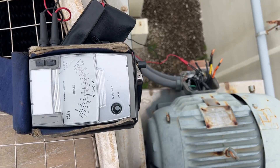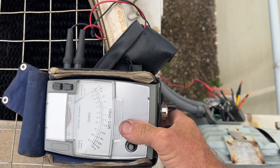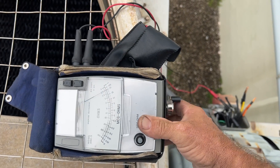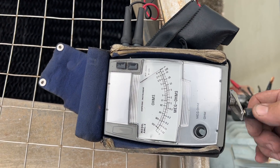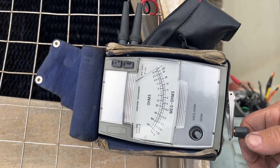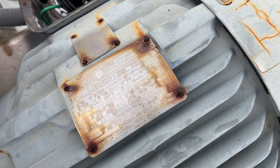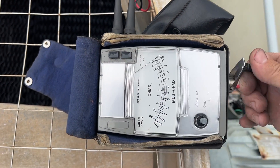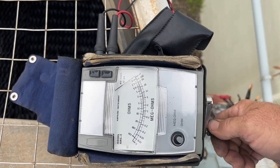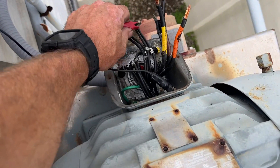Don't look down. We're set on big ohms — megaohm range. Let me do this with one hand. That's one lead to the motor. Nothing — they're all pretty much going to infinity. So I don't think we have a bad motor here.